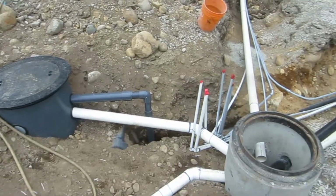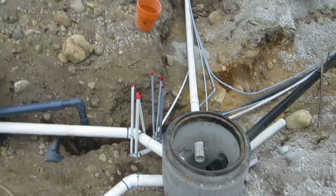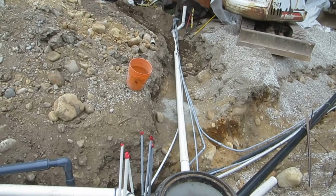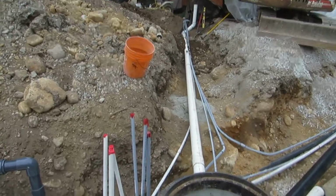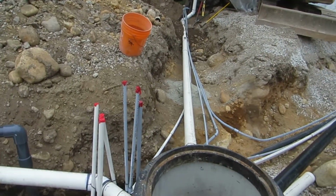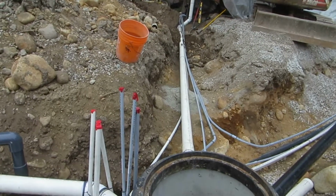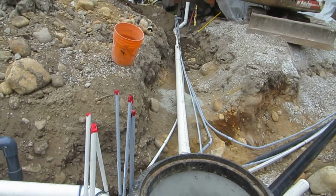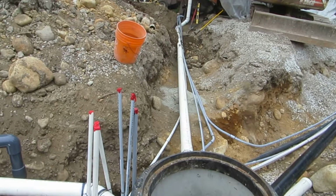We're also going to, and that's the pipe right there, it's a 3/4-inch line fed back to the house. We are going to feed the toilets and possibly the cold water of the washing machine as long as the water quality checks out. I need to check for things like heavy metals and other contaminants that might affect specifically the toilets, because we do have pets, namely cats, that drink out of the toilet from time to time.